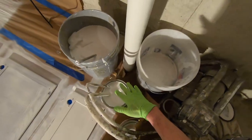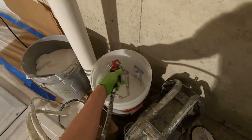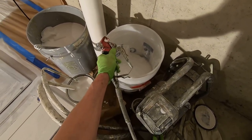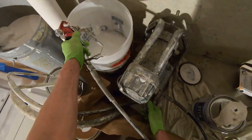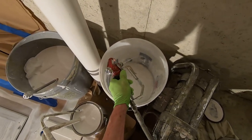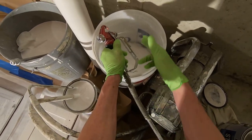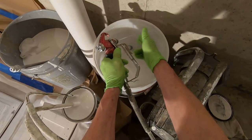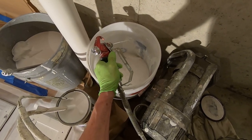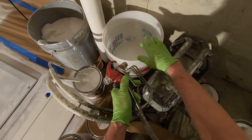If there's a little bit of water, it's going to mix that small amount into the bucket. Now we're going to leave it on prime so we don't have a lot of pressure at the gun, and we're going to get rid of the water in the hose. Now we're spraying — I take it off prime and it really starts moving the water through. We're going to start seeing some paint. I'm spraying on the side of the bucket. We're going to waste a little paint. You've got the paint and water mix coming out — still water — and now we start seeing paint. Now we've got full paint.